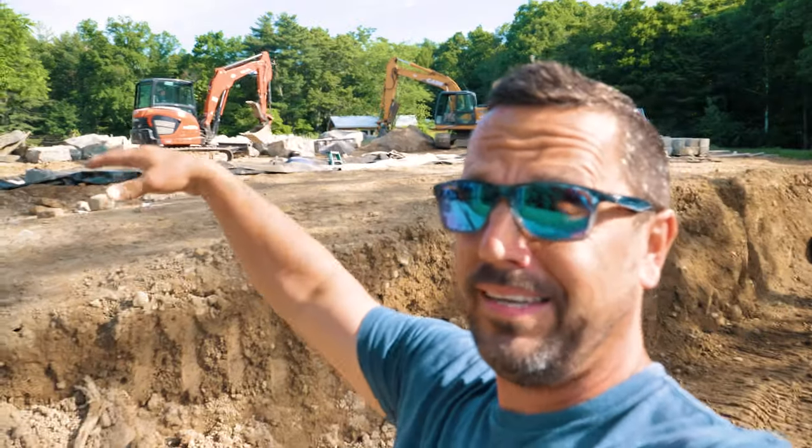So basically when we fire these pumps up, they're gonna fill up that wetland, fill up the top of the pond. In order for it to get over this waterfall, it's gonna have to raise up a couple inches. So all that water is water in motion. And when we shut this off, all that water has to be able to go somewhere. So the capacity of this reservoir has to be at least 2 times the amount of water we have in motion. We're gonna have about 1,800 gallons, so 4,000 will more than do it.